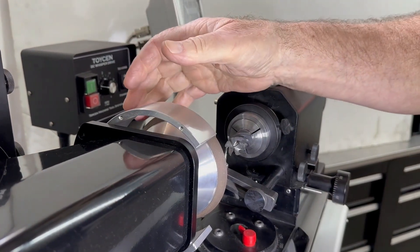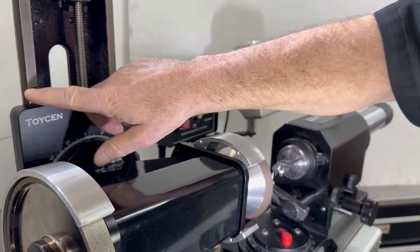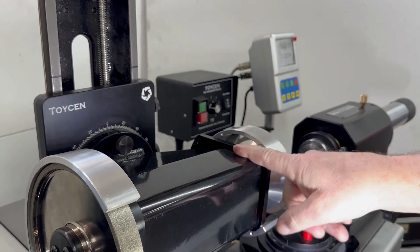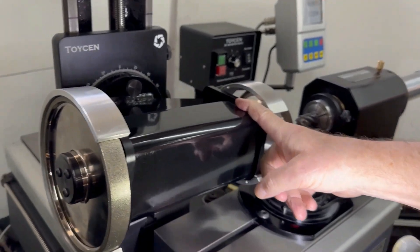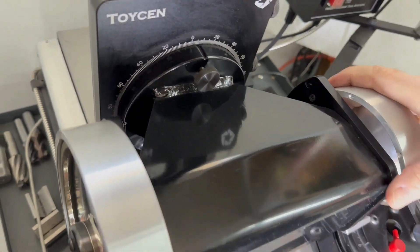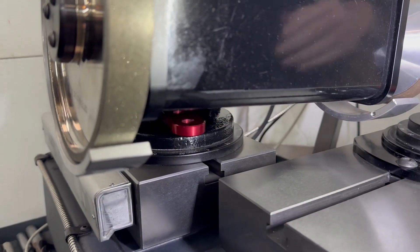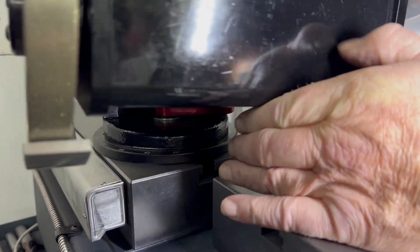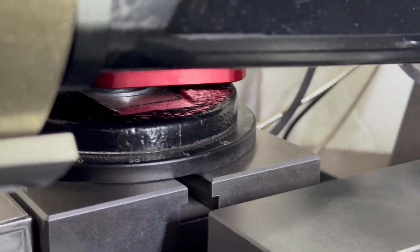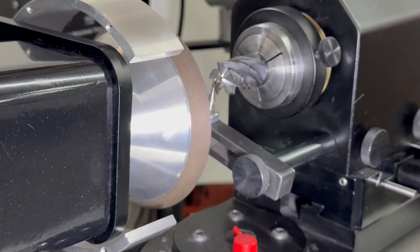When it comes to how to set up this, the height doesn't matter — the approach is what matters. So you can have this at any height. These two lines here represent when this wheel is on center. As you can see, we're below center. We're using the long end of the machine. On the Cutter Masters Professional, usually one end is a little bit longer. When it comes to orientation, you want to have this orientation like so — make it so the wheel's a little bit proud. So we're just coming just past zero there, and you're now cutting with the very corner of the wheel. Because the corner of the wheel does deteriorate as you're grinding on a resin bond wheel.